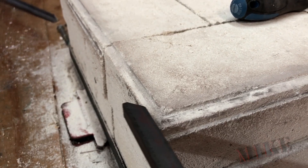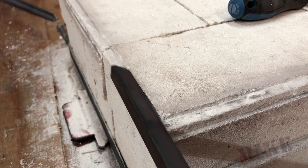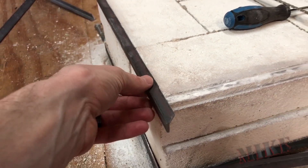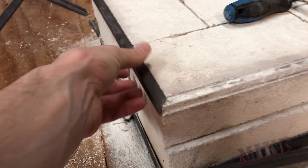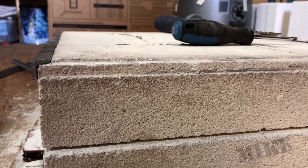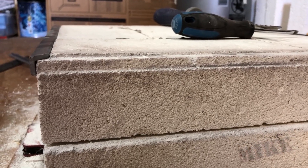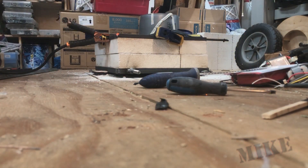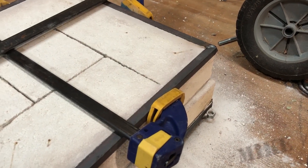Here I'm using this little piece of three-quarter inch angle iron to actually carve the groove in the lid that's going to support these bricks. It's going to go in here just like so. You can see here I've got the top — which will eventually be the bottom — flush all the way around, and so I will simply weld these four in a frame to hold the bricks together, just like so. You can see them there before I cleaned up the welds.